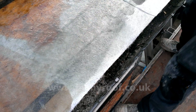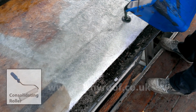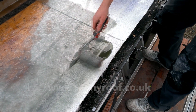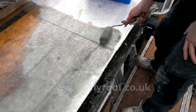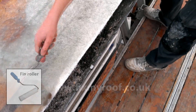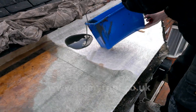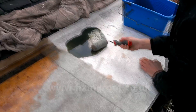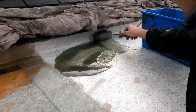Be careful near the edges though, but again don't skimp. Have a small consolidation roller on hand — this is for if you see any bubbles, and to roll your joints or overlaps. This will consolidate them down and make sure they're perfect. I can highly recommend a thin roller as described on my website. On the upstands, push a nice big tide of resin uphill and you will find it wets out very fast this way.